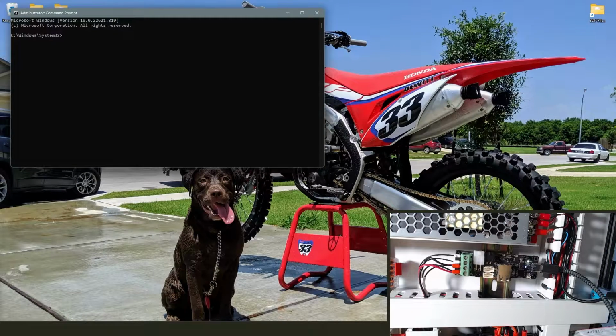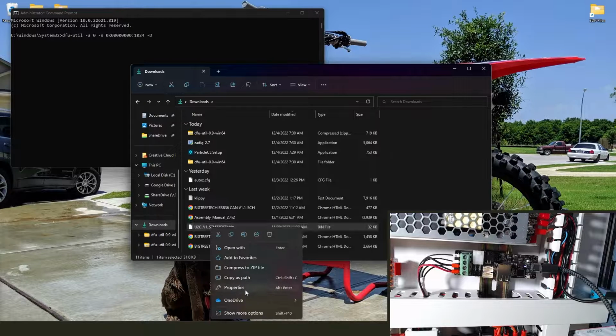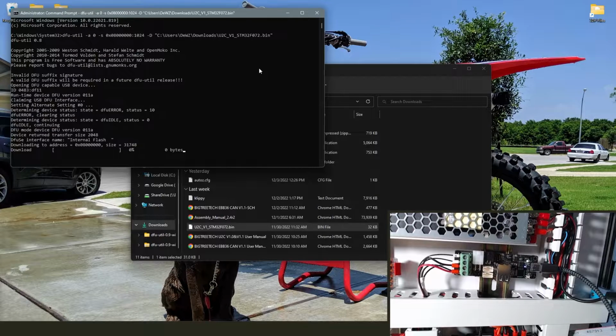Then you'll come down to your command prompt, and you're going to type this in. I'll put this in the description just so you can copy and paste it. You're going to have to update it to your correct file and your file address, but you can copy the first part. And then when you get to the file extension, make sure you're using quotes, especially if you have a space in your directory. Like my directory has my name on one of them, and so there's a space between the first and last name. That'll ruin it if you don't have quotes.